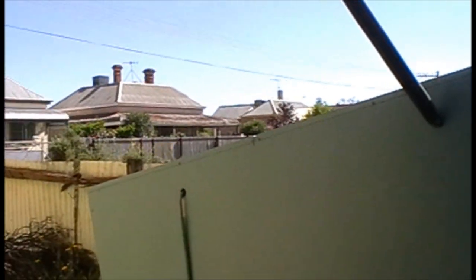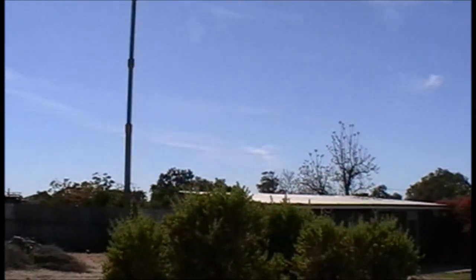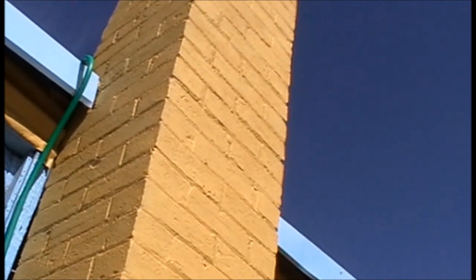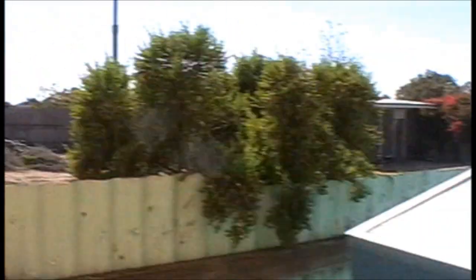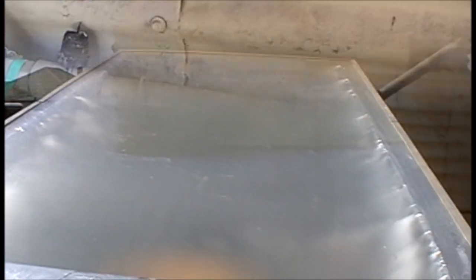The aspect of the batch heater — it faces near enough northwest, just because of space constraints along the side of the house here. With the house and the chimney, we couldn't get a full duration of sunlight. But the sun rises out over there and tracks across to there, so of the full arc we're getting probably two thirds of the available sunlight in a day on the collector panel — generally from sunrise until about 2:30 in the afternoon.